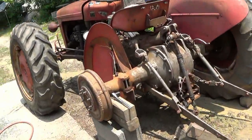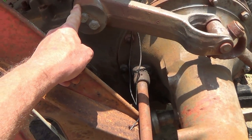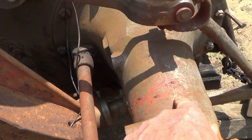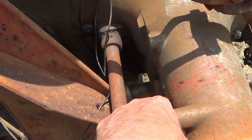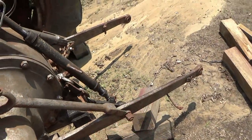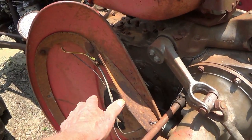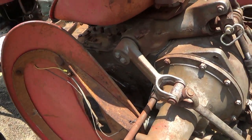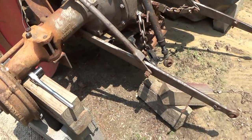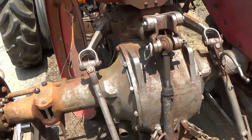What they done here is, this is above the axle. See this lift arm down here? It's not center. It's not here. It's slightly above here. So therefore, when you pick up a lot of weight here, even though this is all back here, it helps transfer some of the weight on the tractor. Yeah, 3-point hitch technology, I don't know what you'd call that. A lot of people don't know that. And you couldn't explain it to them if you had a chalkboard in the classroom.